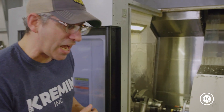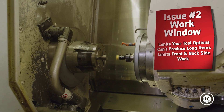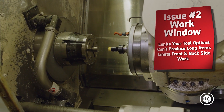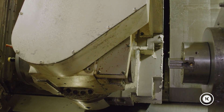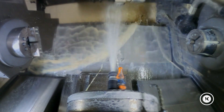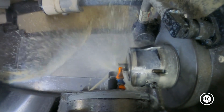The second item we wish we would have known about is the work window itself. I thought we had a lot more room to work between spindles than we actually do. If we take a look at the H1 head in the down position, you're really limited on front and back side work depending on the size of tool you have in your machine. Right now we have a deburring brush in there, but if you had a two or three inch end mill, if you look at where we sit on the front side and then flip the tool to the back side, you really have a limited range on the size of part you can work on both sides. For our project it's not a big issue, but if we wanted to run something longer, we'd have to rethink how we set this machine up.